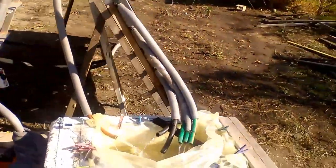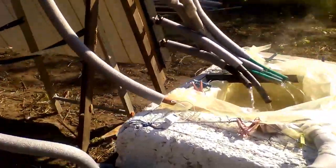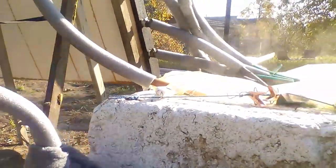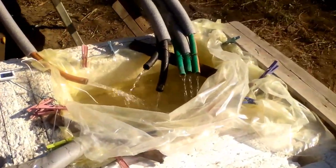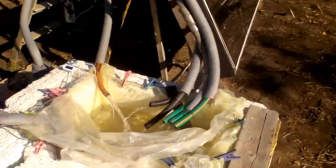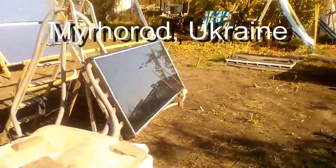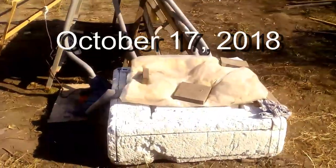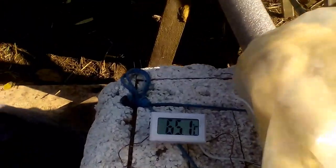This is one of my experiments. The water of this tank is moved by this pump to the inlet of the solar collector, and now each of the five polymer sleeves has a separate outlet because I wanted to be sure that the water flow through each of the five sleeves is about the same. I am showing how this solar collector has heated 42 liters of water in the tank from a temperature of 17 degrees to 65 degrees Celsius over three hours.